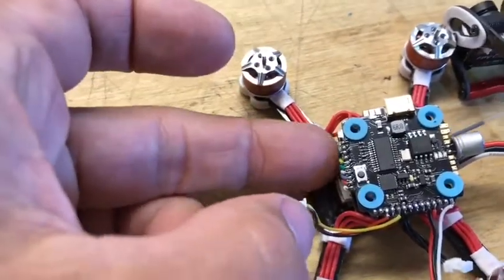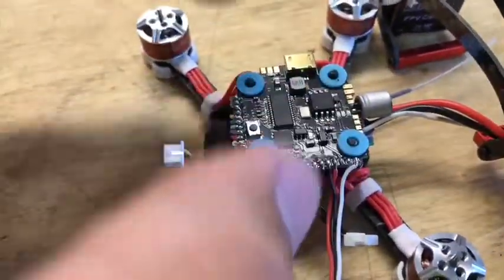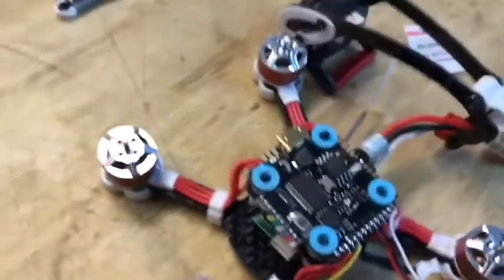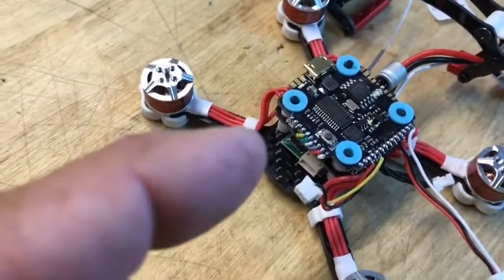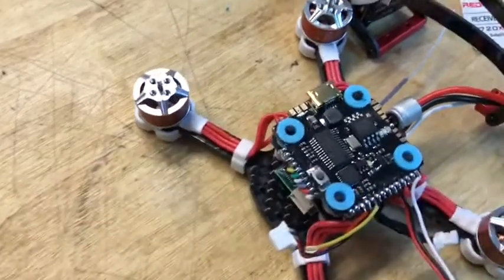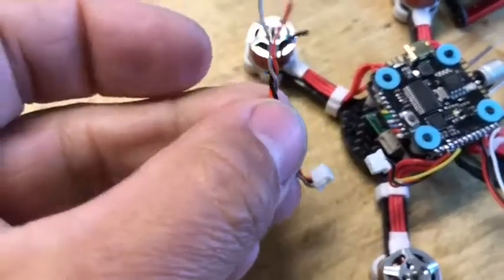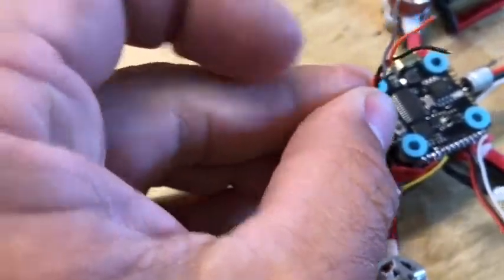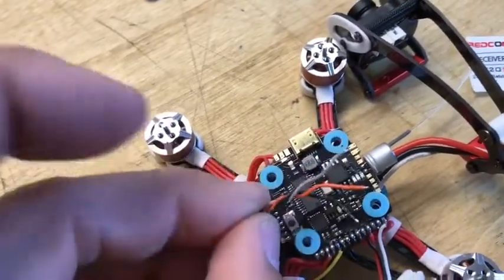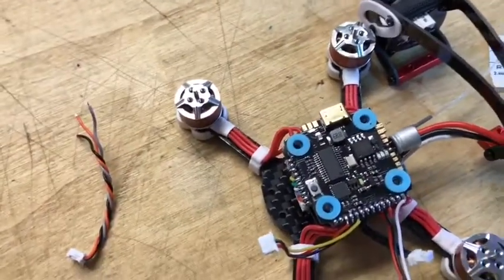They have changed these a little bit, so the screws go all the way up through the plate. They don't have that anti-vibration little plastic doohickey that they did. This just has stacks of washers up long screws, and then it has the vibration plate right here. So I'm going to hook mine to the bottom. And here is my wire. It's going to be right down below. I could find room there, and then I will do all my wiring right over here, soldering, and make this where it has slack so the vibration plate still kind of works, anti-vibration.